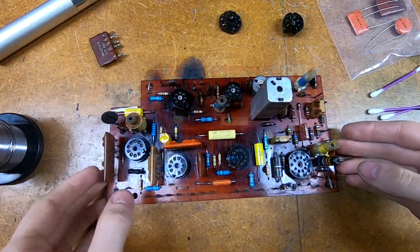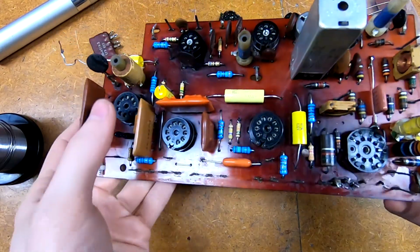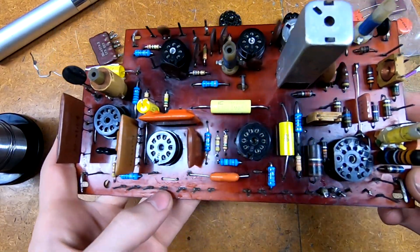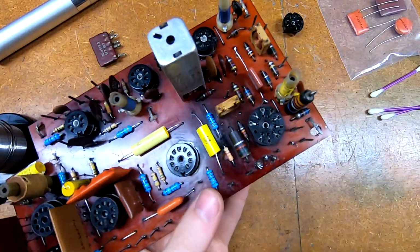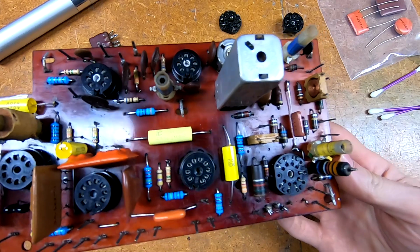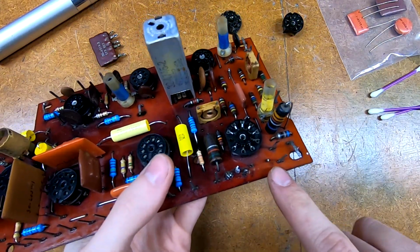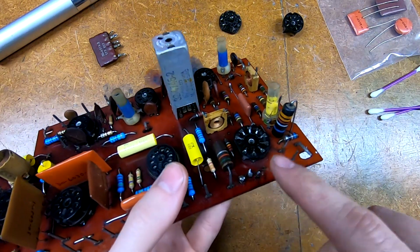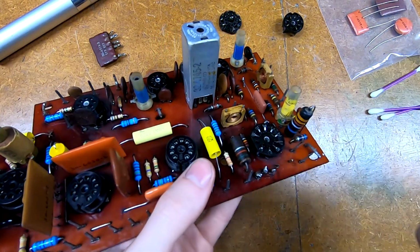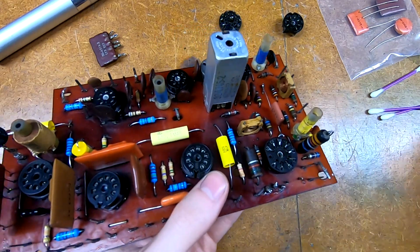Okay, I am 3/4 of the way done with putting in the lower tube sockets. Those guys went pretty smoothly. For this last one, though, I did want to show what it takes to get one of these out in a reasonable amount of time. I've already removed the couplet that was sitting down here. These are the solder stumps from the old one that it was attached to, and I'll pull those out afterward and put the new guy in.